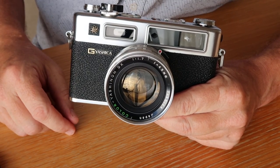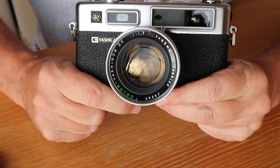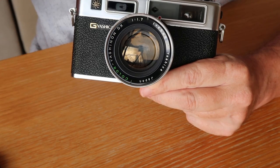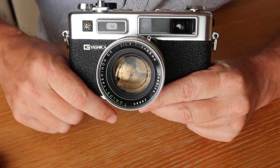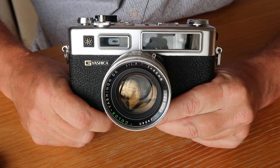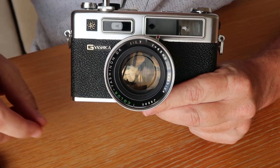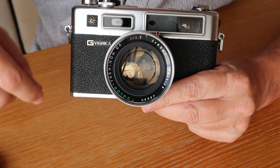There are very few things wrong with these cameras that are not fixable, except occasionally the electromagnet which operates the shutter can go bad - in that case it's not worth fixing unless you have a spare magnet. Another problem is sticky shutter blades, especially on earlier models. The later cameras have a different coating on the shutter blades that prevents oil from contacting adjacent blades. The earlier ones have a shiny gunmetal finish that is much more prone to sticking.